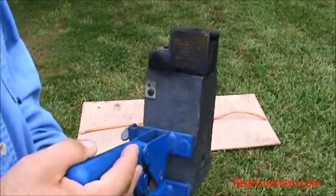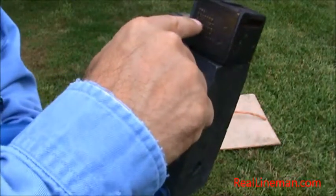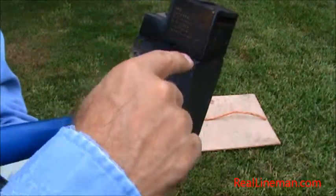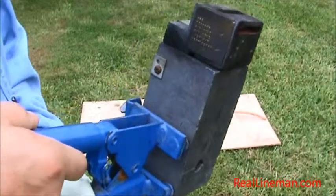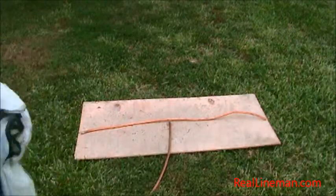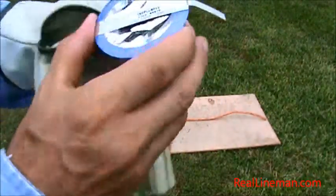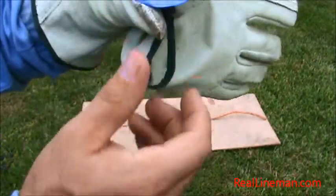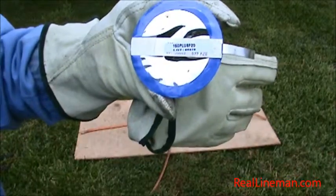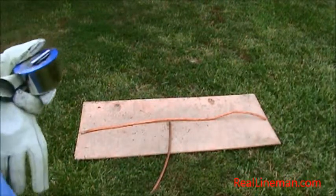What we've got here is a T-mold. You want to look at the tag — it's a four-aught connection. Right here at the bottom it says 150 plus, and that means that's what size shot you have to use inside of this mold. You want to make sure your shot is the right size — as you can see, we have a 150 plus, so we have the right size shot.